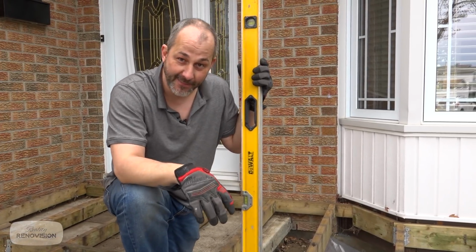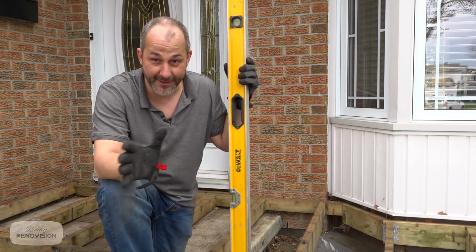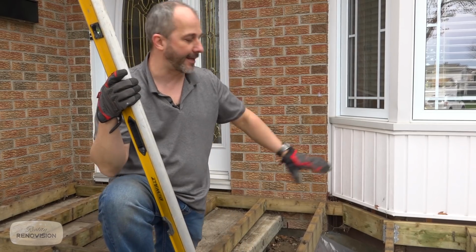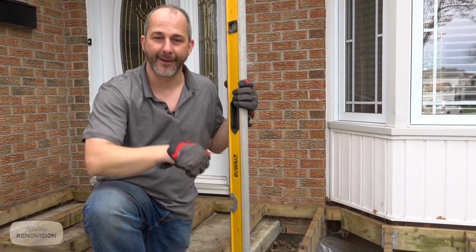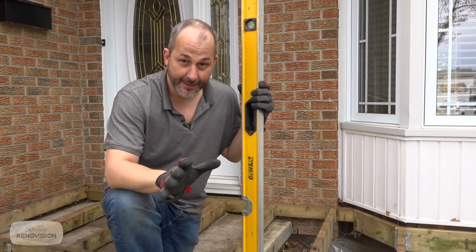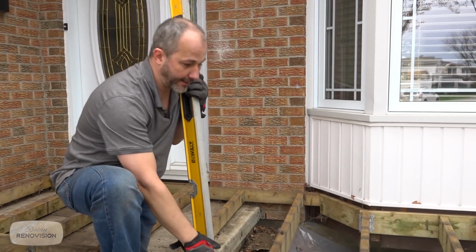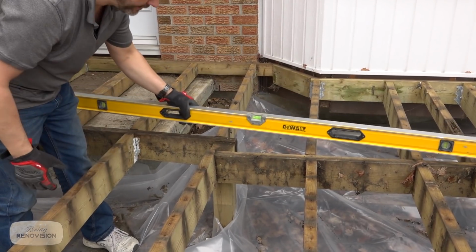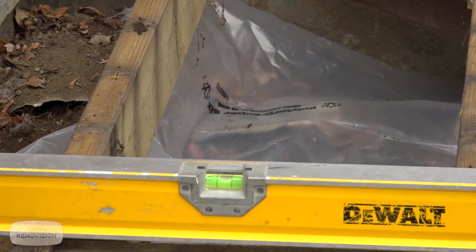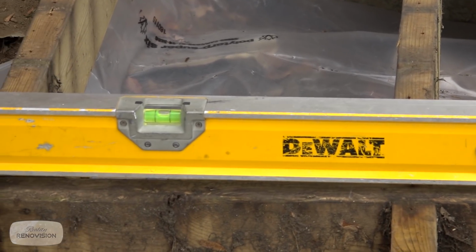In this situation, this DIY homeowner that built this deck did a combination of both. And you'll see this all the time. People think it's a really good idea to attach to the house and then they just drop some 4x4 posts into the soil. They'll pack it down a little bit maybe. It's all a disaster. So we've got all kinds of movement going on. The middle is almost completely sunken right out of sight. And I'll just drop this in here for you to have a quick peek. There is a 1-inch gap over 4.5 feet here, and this is already the low part of the deck.